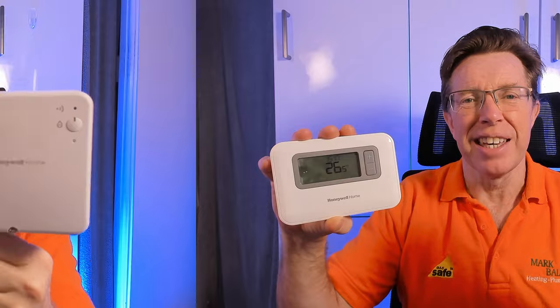That's why we need to rebind them back together. You'll find the receiver unit somewhere near your boiler, so you need to find it because we do need both units to bind them back together. I suggest you watch the video all the way through before you go resetting your Honeywell T3R, because once you factory reset it you'll no longer be able to turn your heating on and off with your programmer.